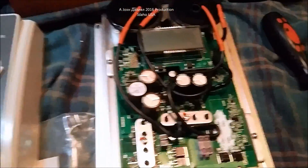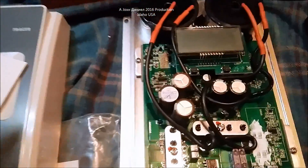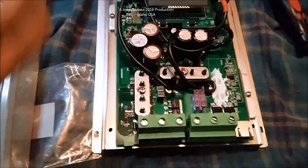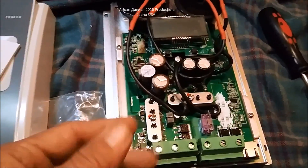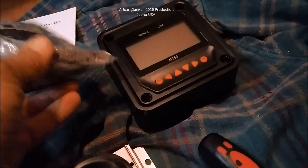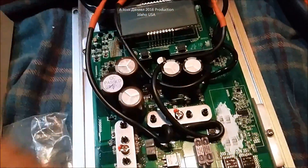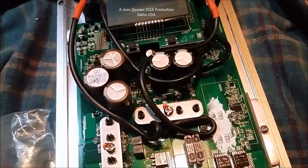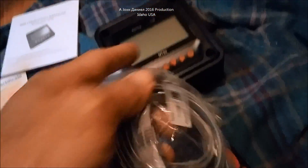Make sure to evacuate air and bring in fresh air to keep this cool — design it how you wish. The heat sink looks impressive, but if you're in Texas you might want to add some cooling. The MT50 is a controller that helps you set all your parameters: when it's going to bulk charge, float, top off your batteries, and what your low and high start thresholds are.